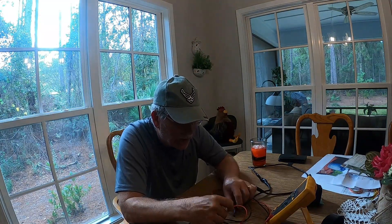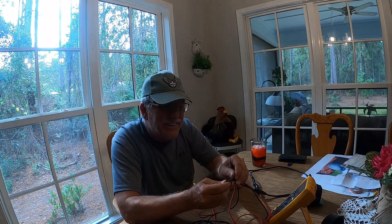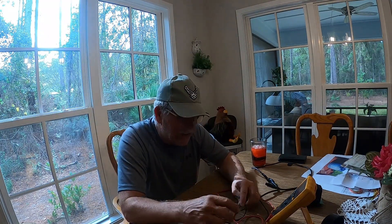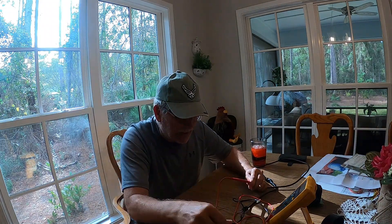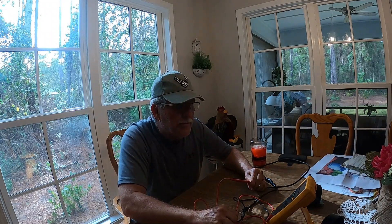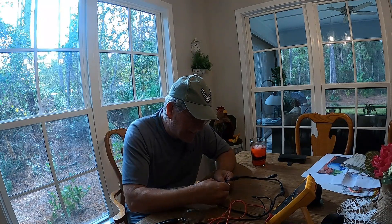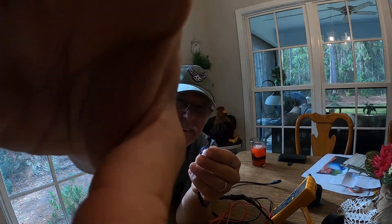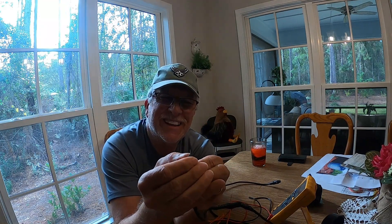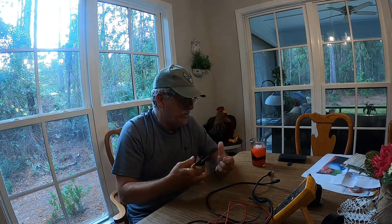What I've done is cut the wire all the way through - that was already done anyway. I've got a smidge of wire left in the connector. First thing you want to do is make sure that wire is good all the way down to where it connects into the NMEA 2000. I checked it with my multimeter and it's good. Then I went to my wife's sewing area and got a sewing machine needle to clean out that connector where the old wire was - you can see that pin moving back and forth. Got it all cleaned out.